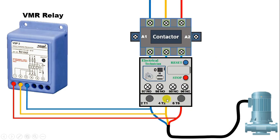For now, the connection between the contactor and relay is done from below. If you want, you can connect this from the top also, but one problem you may face when doing connections from the top — I will discuss this later. If here some kind of problem occurs, this relay will turn off this contactor.